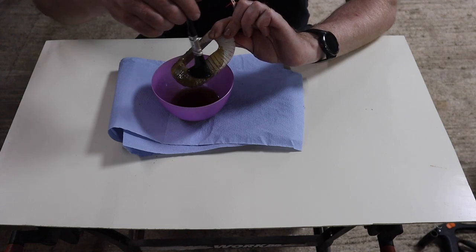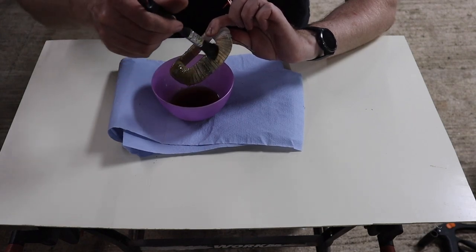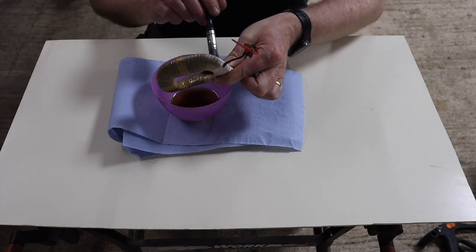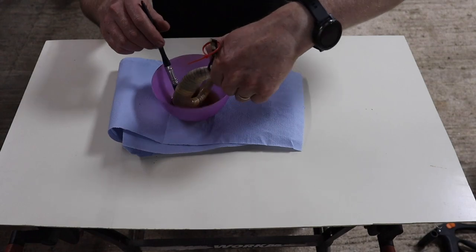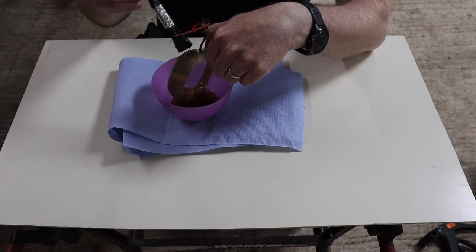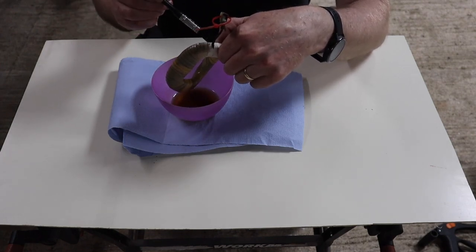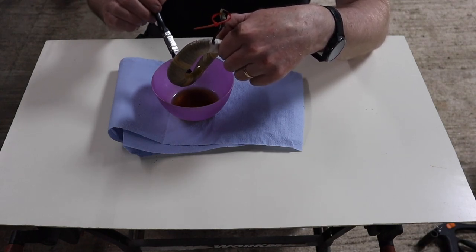You've got to be careful about adding too much thickness, because obviously this needs to go inside the dynamo. It's got to fit, and the pole shoes, sorry, field coil shoes, need to hold it. They need to go in the center, and you don't want those being too tight to go in. And of course, remember, you've got an armature running in the middle here, stator winding, which, not that it would, but you know, there are clearances that need to be considered inside the dynamo.